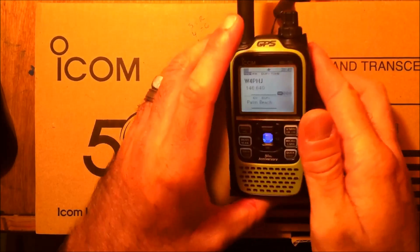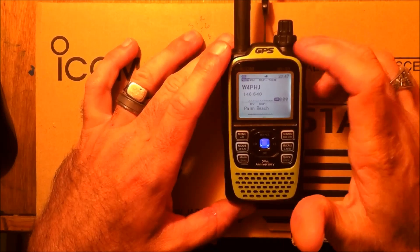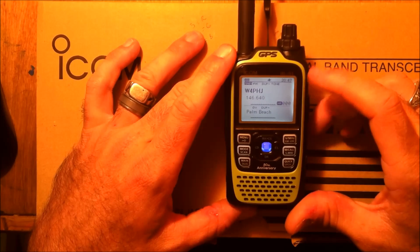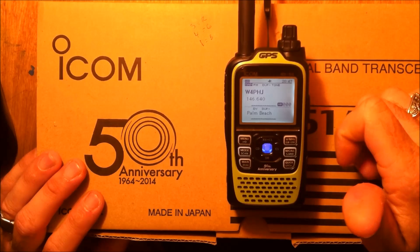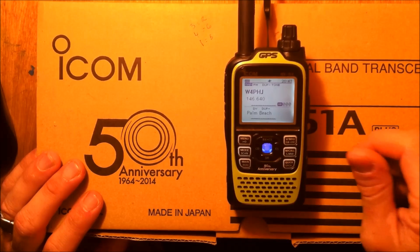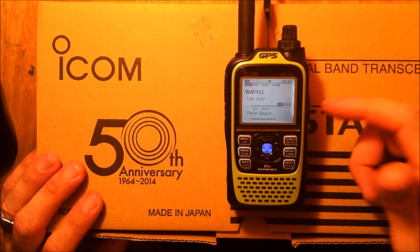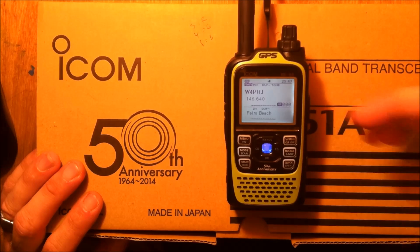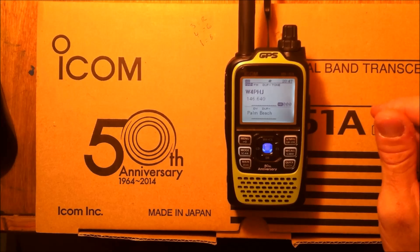It's got a nice size screen. While you're holding it you can see enough information, and we'll go into the GPS in a minute. It says GPS and it'll display all that on the screen. You have dual band, dual mode, dual receive — independent A and B. So you can listen to an analog repeater on top and a digital repeater on the bottom, or AM broadcast on top and an analog repeater on the bottom. You can't listen to two digital signals or two AM broadcasts, or a digital and FM narrow at the same time, but you can do one digital and one analog together independently.